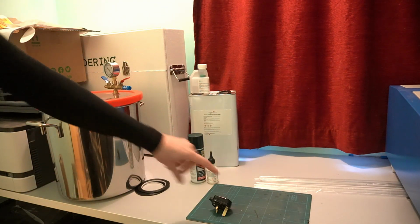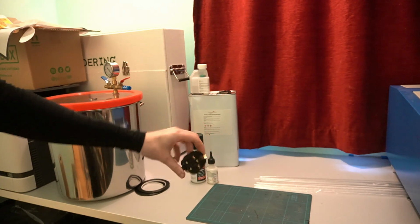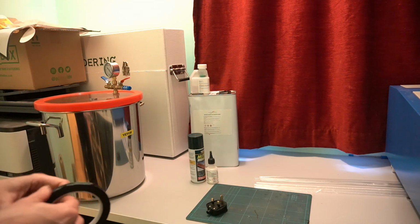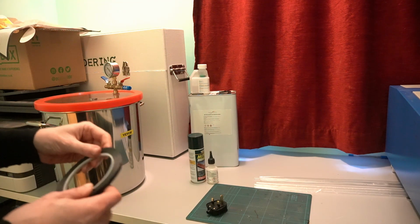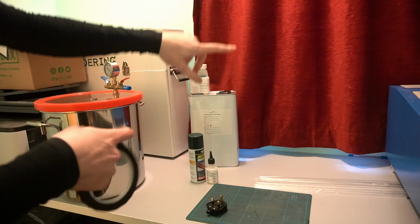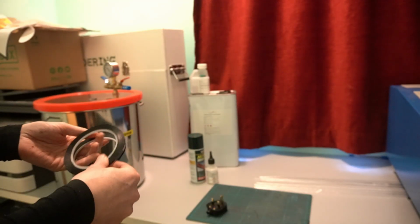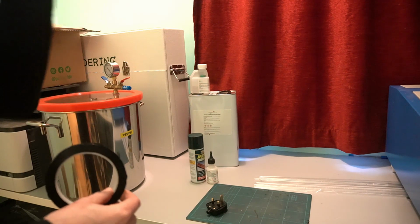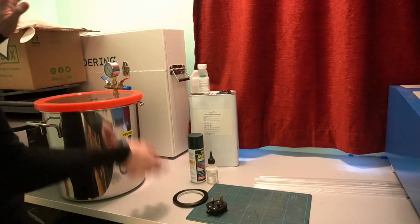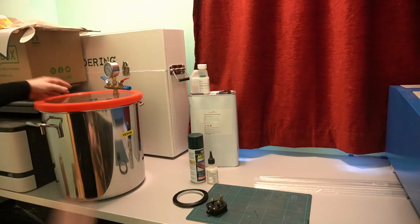And part of the reason I'm doing this plug is I want to see if the acrylic rods disappear in the resin or whether they're going to show up. On an exploded diagram, there are lines showing the parts are all apart, and then there are dashed lines between them. So we're going to use the acrylic rod and some of this very tiny black tape to indicate those dashed lines as well. And then we've also got a vacuum chamber, technically pressure, to try and get any air bubbles out.